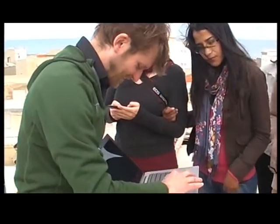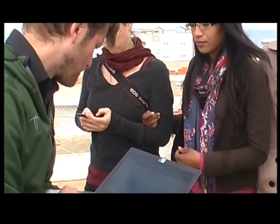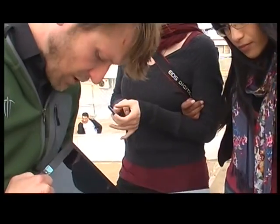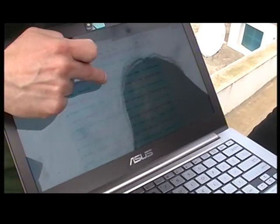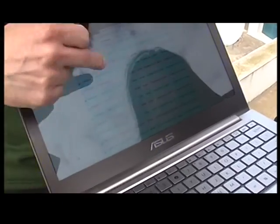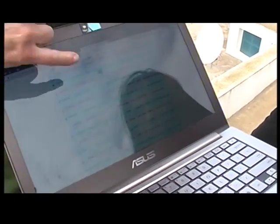Okay, we'll try again. So let's see, I need to scroll down. So now we can look at the same mesh connections, and now negative 77, negative 63, which is very good, negative 56, negative 85. So there's at least a few: negative 63, negative 58, or 56. Those are very good. So those will be strong mesh connections.